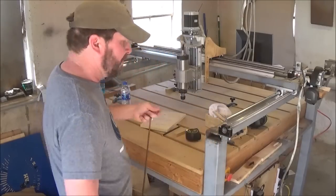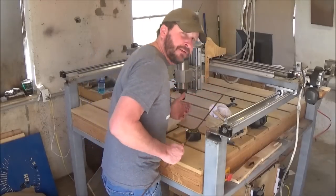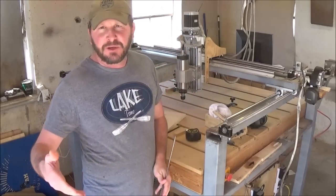Now I've got to qualify that. 36 3/8 is actually a little higher than what is standard. I'm just a shade under 6'2", and I built it to my dimensions. That way, whenever I'm standing at the table, it hits me right above the waist. I don't have to really work or bend over too much. It's just an easy, comfortable working height for me. So absolutely, if you're building it yourself, build it to your dimensions at a height that's going to make it comfortable for you.